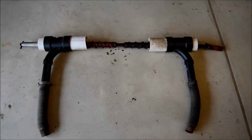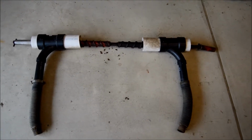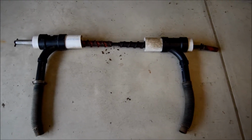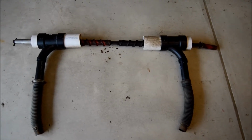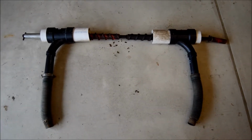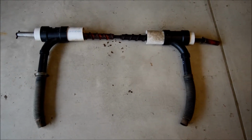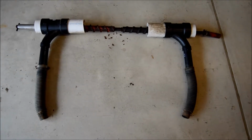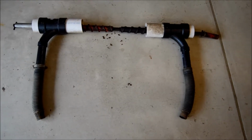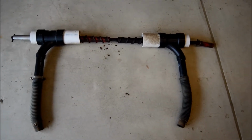And so this is what it's going to look like inside the fertilizer box. All I have to do is drill a couple holes in the bottom through existing holes in the fertilizer box, and run some bolts down through them. I'm going to use a button head bolt, like a lag bolt, so it doesn't interfere with the auger at all. And then we got 6-inch, 1.5-inch pipe coming out the bottom, and the fertilizer will come down those rubber flex lines to the disc openers for the fertilizer for side dressing. So next step will be to install this in the fertilizer boxes.